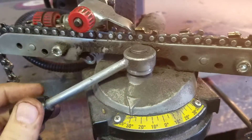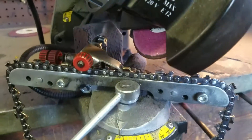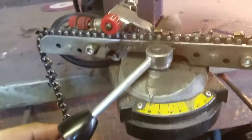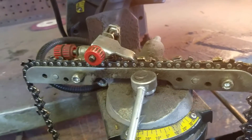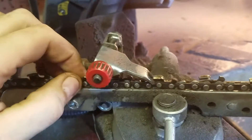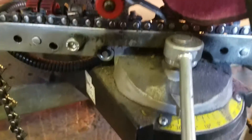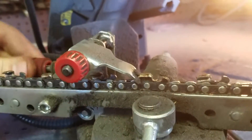I've already adjusted this. It has a hydraulic lock on it, so every time I lower this down it actually locks the chain in place, so the manual lock isn't even really needed. But some machines have a manual lock — this here — and I just keep that a little bit snug. Then we have this adjustment for forward and back, basically how much you want to take off.